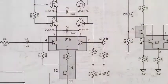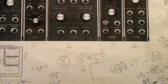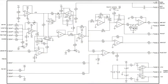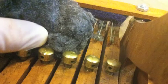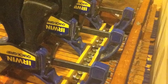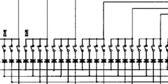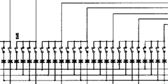I then did lots of research on what I actually needed to make the synth work. Finding Moog schematics was not as hard as I thought, so I chose a design for a voltage-controlled oscillator, a low-frequency oscillator, a ladder filter based on the original Moog designs, an envelope generator, and a voltage-controlled amplifier. The difficult part was finding a method of making the contacts on the keys into a control voltage, because most homemade synthesizers are controlled from a digital MIDI input. But after spending hours on the internet learning how everything worked, I had a plan for a 64-key keyboard scanning matrix.